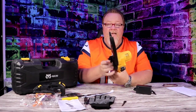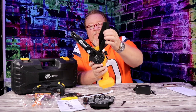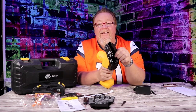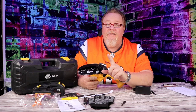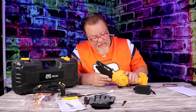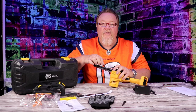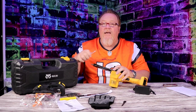Chainsaw, like I said, it has that good feel to it. It's got the backsplash guard right here. That way, when you're using it, you aren't getting all those wood chips in your face. So it's a safety add. It's got your quick adjuster right here. Once you use it for 2 seconds, your chain is hanging down. So what you're going to do is loosen this up a little bit, and then it's got this little tensioner. Then you can tension it. Because that's what chainsaws do. The chains, once you use them, they get slack in them, and you have to adjust them.